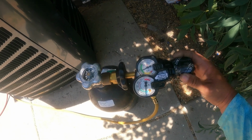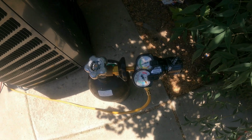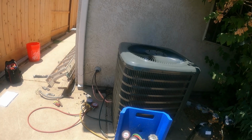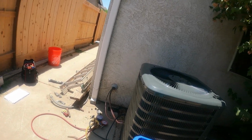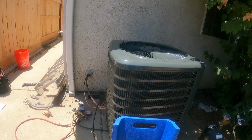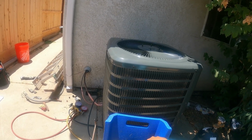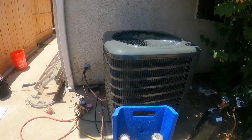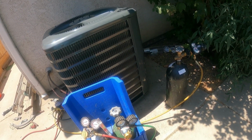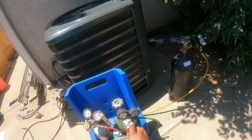All right, let's go ahead, lower this to our brazing pressure. Let's get to work. Now, how do we set up our oxygen and acetylene? First of all, you want to make sure all your fittings are tight, everything's good. And when you do this one, you want to open your oxygen all the way, all right? And I like to use around 20 psi on the oxygen side as my feeder, and it's dropping a little. So, and then you regulate it with this.